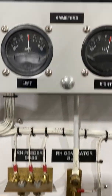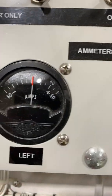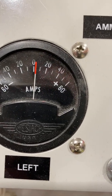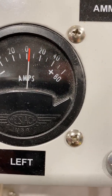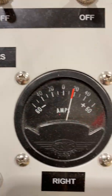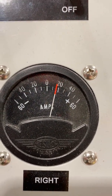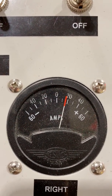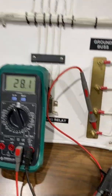Remember: adjusting the voltage so both generators are the same is one of the first things you want to do. Now I'm going to turn on the left generator to see how much it draws — if they're balanced it should drop by half and equalize. I energize the left, and the right hand side is drawing 20 amps while the left is still at 0, at 28 volts.